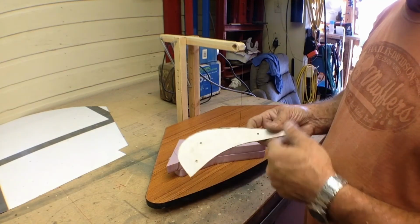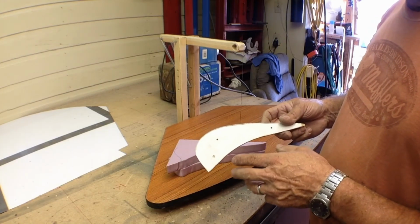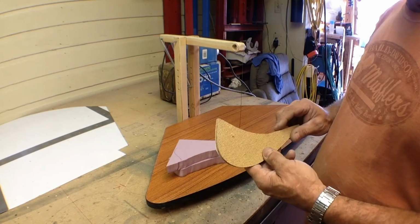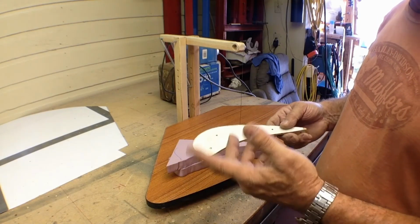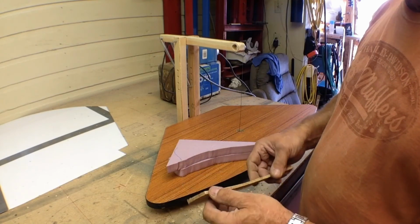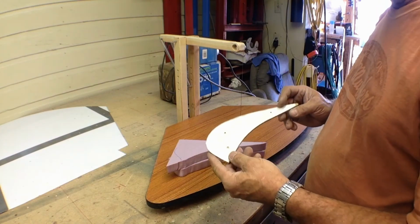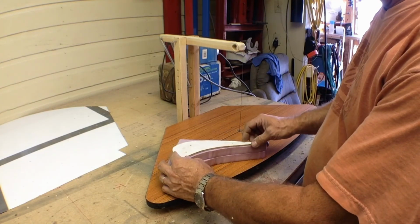So anyway, I cut out my paper template to match the end of the slat, and then I glued it onto a piece of tempered hardboard, 3M Super 77, of course, links in the description below. And then I went ahead and cut it out and sanded it. So there's my profile for my wingtip or slat blank ends.